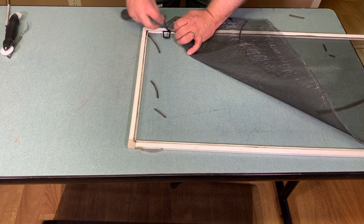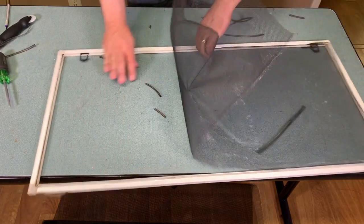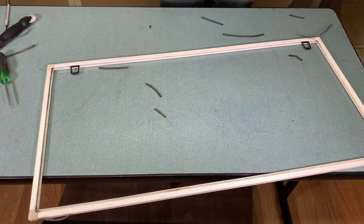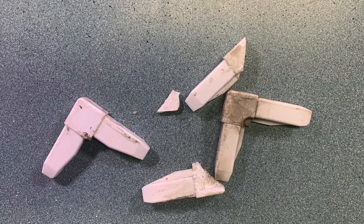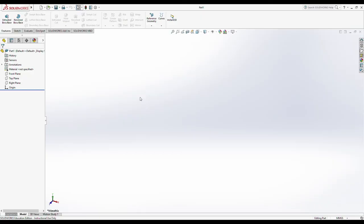Starting that last pass, just going to dig it up again with the awl and then use the screen as leverage underneath to pull up the spline. As you can see the screen I removed from my daughter's bedroom is all broken. The corners that hold the frame together were cracked and broken, so I needed to model up some new ones that I could print on my 3D printer.